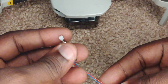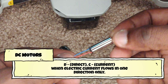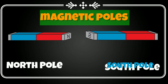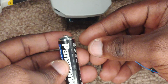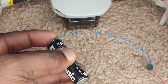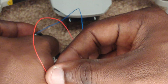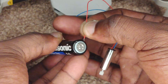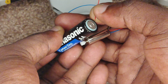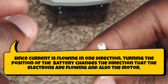Another important thing we need to know about DC motors is that the polarity of the magnets continuously changes as the motor is turning. So north and south poles are the two poles normally found in magnets, and if we connect these two wires — a positive and a negative end — and connect this end to our positive, take a good look at the turning end, or the shaft. It starts turning. The minute I stop the electricity it stops turning, and if I turn around the battery then the direction of the wheel also turns in the opposite direction.